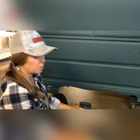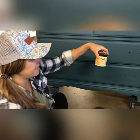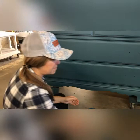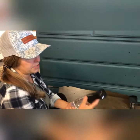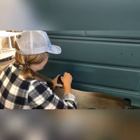We have some leftover spray mix in the Antebellum Blue, and then we're also going to be using, like we talked about earlier, the Gulf and Lemonade. We also have our spray bottle, and this is great because it gives a really fine mist. If you ever use just a regular spray bottle, it can really change the look of your finish. It could really ruin it. So I would use a spray bottle like this that has a really fine mist. What we're going to do is go over this with a light coat with our brush.